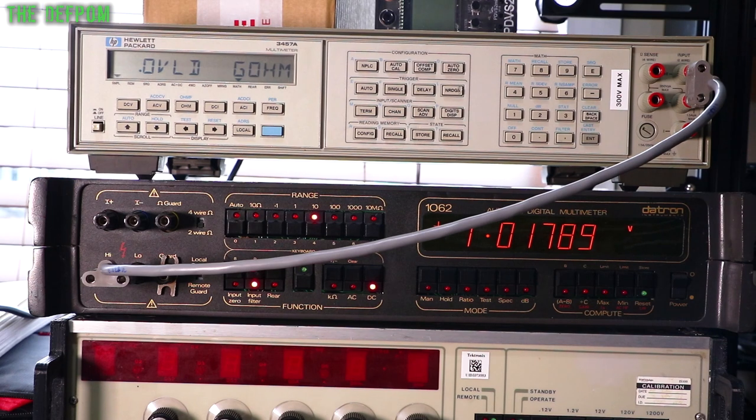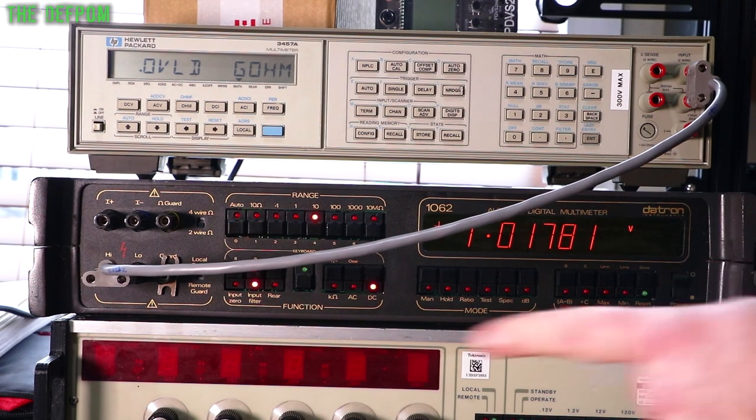Quite commonly, multimeters have got a 10 mega ohm resistance. You think 10 mega ohm, that's fine, it shouldn't affect anything. Well, yes and no. Generally no, but if you're measuring across a resistor divider, yes, it will have an effect. I can actually demonstrate this on here.